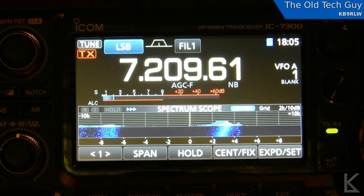Now it's moving even slower. But anyway, that's what the noise looks like, that's what it's generating, and that's what that offset control is for and how you can use it to adjust the noise away on your power supply. That's how you can use that noise offset — or whatever they label it on your particular power supply — to dial away the interference that the switch mode power supply can cause on your HF radio.